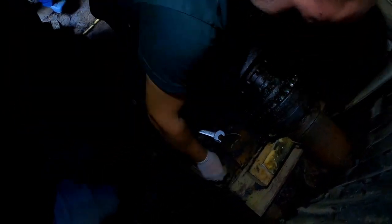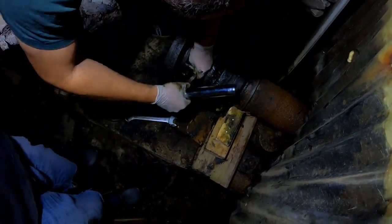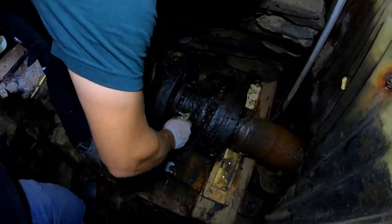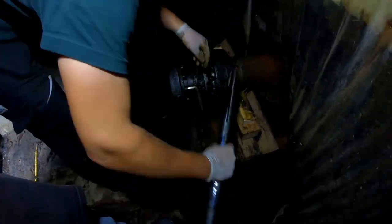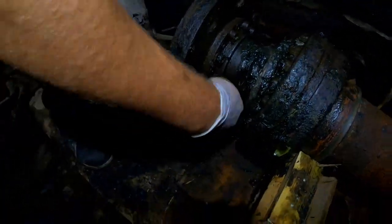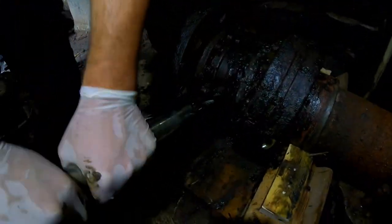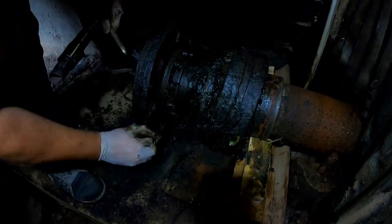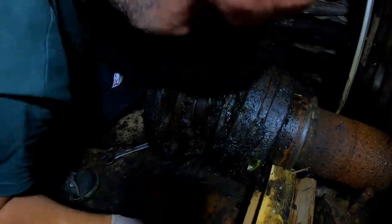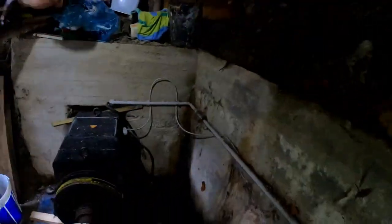Back to the bearing, or rather the bearing housing. Two wooden blocks, an upper part and a lower part, held together with two bolts, were the outside shell of the stainless steel roller bearing. These wooden blocks would tip ever so slightly from side to side with the expansion or contraction of the steel axle due to temperature changes. We calculated that it would be less than 2 millimeters between summer and winter.